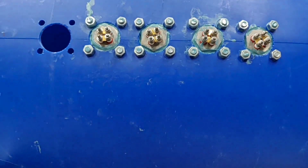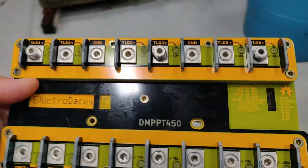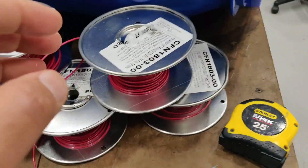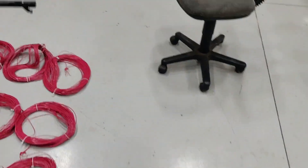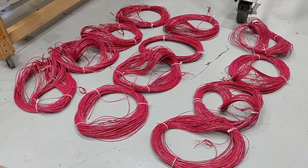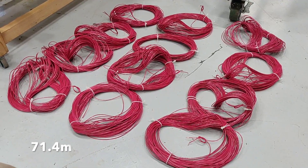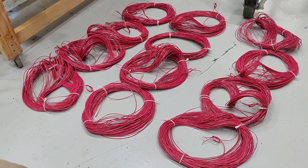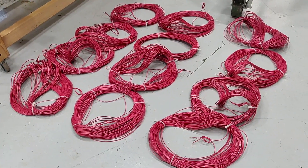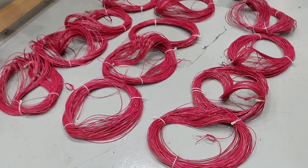I'm using that to create the correct amount of resistance on the DMPPT-450. I also used 18-gauge stranded wire and made loops 235 feet long, which is equivalent to Dacian's specification — I forget the meters, since he uses meters and we use freedom units. Each one of these loops is now 1.5 ohms, and I did test it — they test exactly at that — so all this should come together quite nicely.